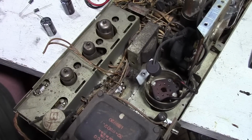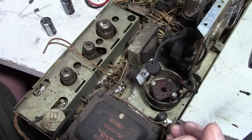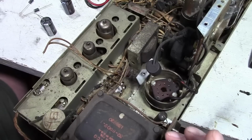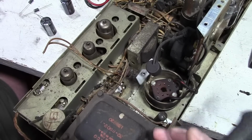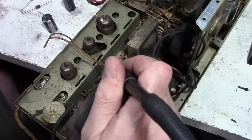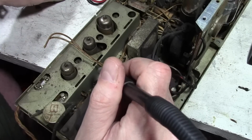I've got to say, this chassis does have a bit of an odor to it. I think it would benefit from a good cleaning. My friend had brought some Simply Green over the other day when we were working on his radio. I think a dose of that or some Pine Sol would help. And I know of one restorer, actually the guy who made those replica networks, who takes his chassis over to a car wash. I'm not quite that bold. I know he's had good luck with it. I know others have taken a garden hose to chassis, and if you let them dry out, they should be fine. I'm a little concerned about damaging fragile wires, so I'm not.